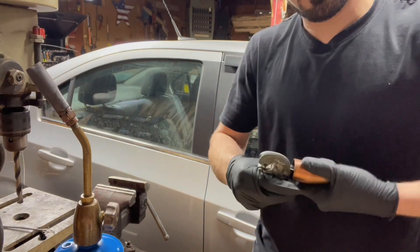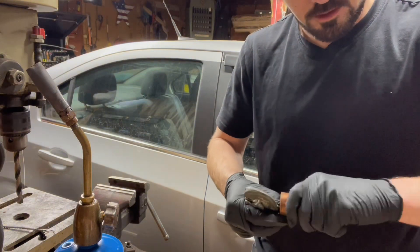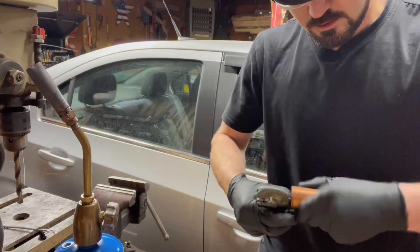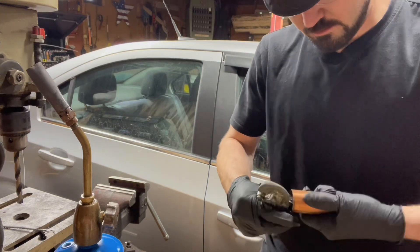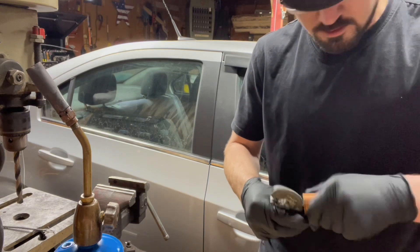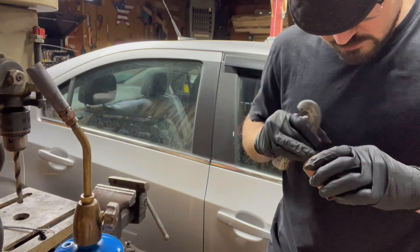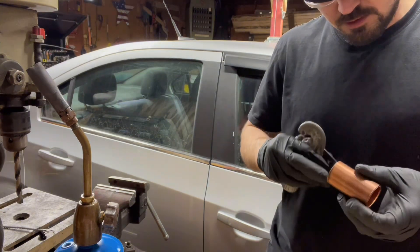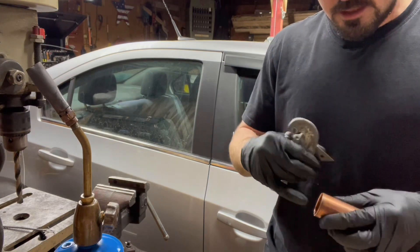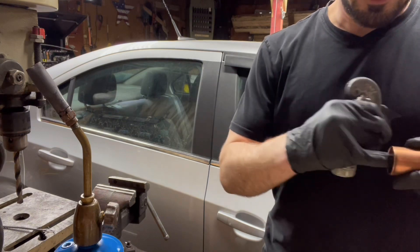If you don't clean the inside of your copper tube, it can fail prematurely. It's something with how it creates turbulence in the line with your water, or whatever you're flowing. If you've ever cut copper before, you know that it gets a lip on the inside edge, and you've got to take that lip out so it doesn't catch when you pull your finger across.